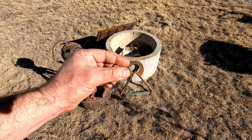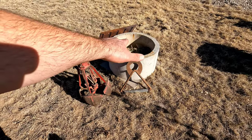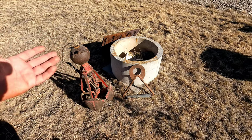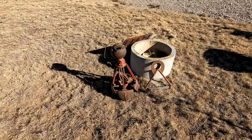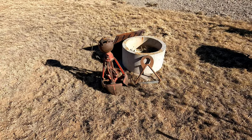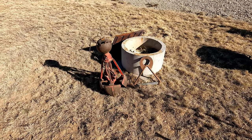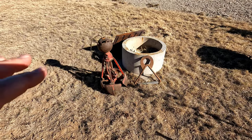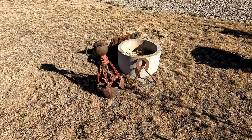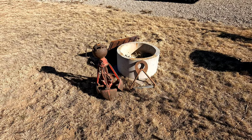The tops of the rings were kind of tapered with a lip — a male and female side just like a pipe. This one's flat so not necessarily a great demonstration, but when they were seated they would seal, though they don't need to seal perfectly since the idea is to get water into them anyway. Once the well was dug to the depth where it was producing a fair amount of water, they'd make sure it was cleaned out, then dump some inch-and-a-half river rock in the bottom. That river rock helped separate the pump from all the silt and things that would accumulate in the bottom of the well.